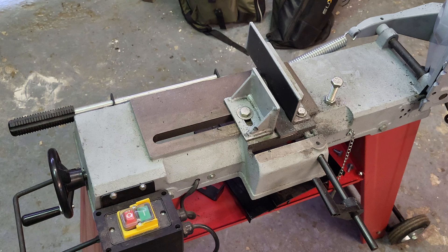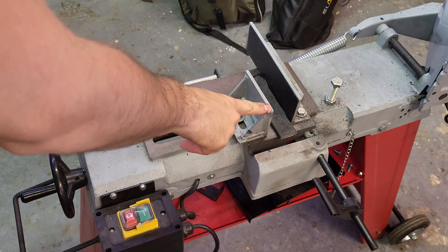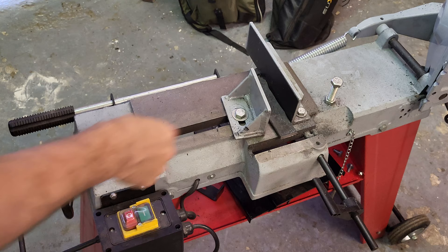The built-in vise is also a bit mediocre — it has a huge amount of backlash and you can't grab smaller pieces, so it's not possible to cut off small strips. If I turn this back you can see the backlash — it wobbles about. You can only fix it by tightening this screw, but tightening it also changes the amount of pressure on the guide screw, so if you tighten it enough that it can't swivel, you can't move the vise either.